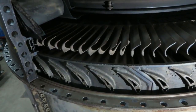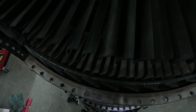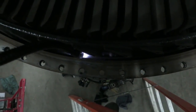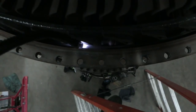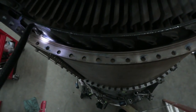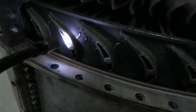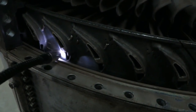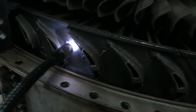Let's change the lighting and I'll try to show you where it comes from. We're looking straight down between the nozzle and the combustor outer case. With a little flashlight here, you can just see the outside of the combustor liners. Between the outside of the combustor liners and the inside of the combustor case there's a space — that space leads right into there. That's the hole that the air goes into to cool the first stage nozzles. The pressure in this chamber is controlled by the leakage out of there and also these little holes that leak air directly into the gas path.